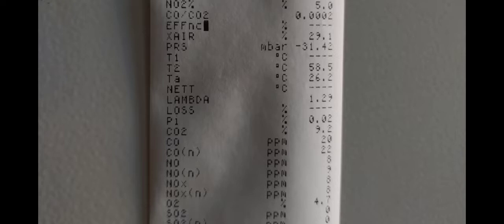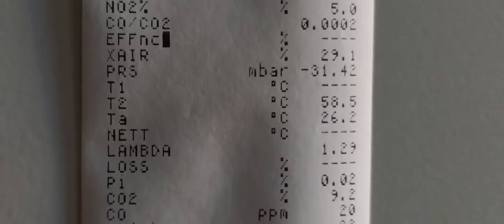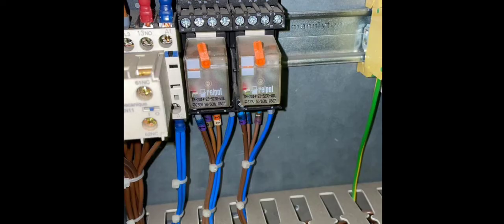Make use of the manometer when working — not all engineers connect their manometers on the boilers when checking burner pressures or working pressures. You can see minus here, but it was actually 31 millibar. A lot of engineers do not actually know that you can use the manometer to record the pressure of the boiler, whether it be the burner pressure or the working pressure — make use of that feature.